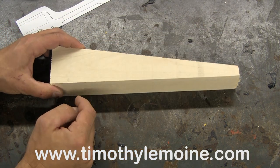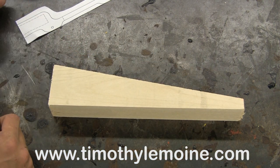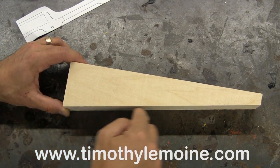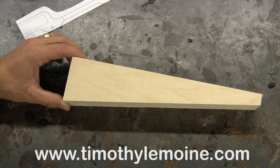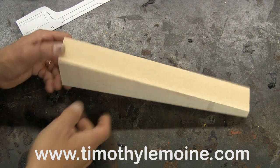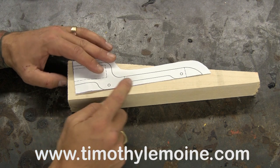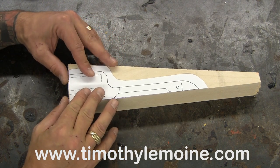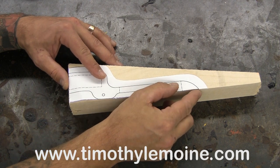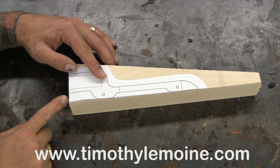Your CO2 car — to have it the correct way — the bottom and the back are going to form a perfect 90-degree angle. If you place it upside down, your bottom and back will not form a 90-degree angle. So this is the correct way to have this thing go. When you glue, it's important to line this up all the way to the back — the word for that is flush — and then all the way down to the bottom. This is going to allow all the pieces you've designed to end up in the correct location.